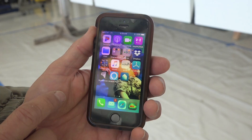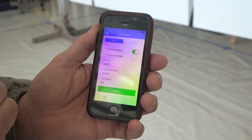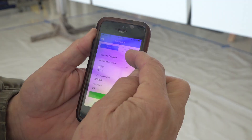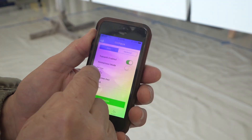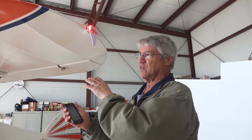Take your iPhone, cell phone, iPad, or whatever, go to their app, and it connects via Wi-Fi to that device. You turn it on to configure, you put transmit or anonymous mode, you put your call sign, your N number, and your ICAO code — it's your transponder code number you get off the FAA website — so it's now officially assigned to your airplane and your transponder.